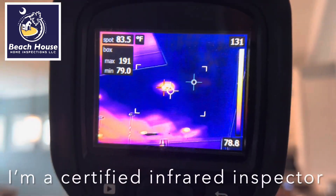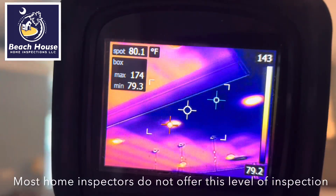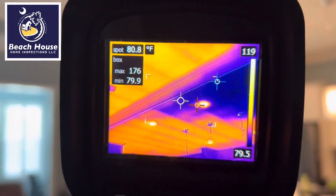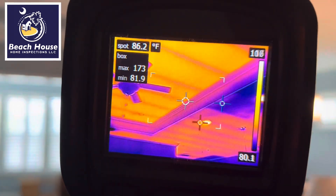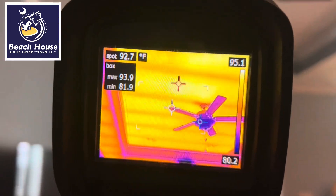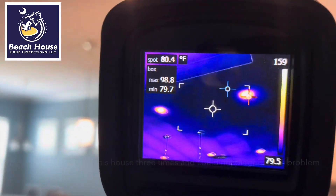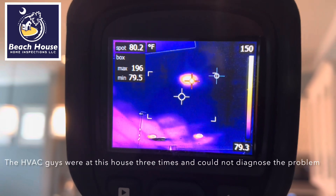This is a 12-month warranty inspection. A home inspector is not required to do anything with the insulation except verify it's been installed. Some parts of the attic were not visible. It appears no insulation has been installed over the living area or the dining area. Some has been installed over the kitchen area.